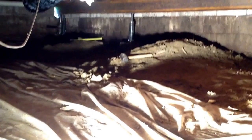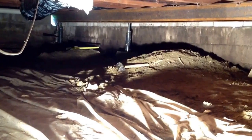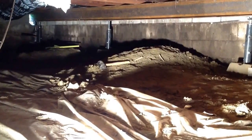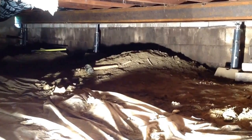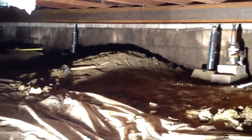That's been a good rule of thumb — a good way to find out how close I am. All homes shift a little bit, so it doesn't have to be exactly perfect; we're trying to get as close as we can. I'd like to report that at this point the house is almost exactly level, within a quarter of an inch, using this process. It's a large, two-story house, so it's worked very well for us.